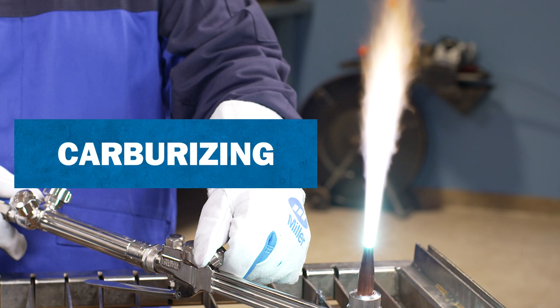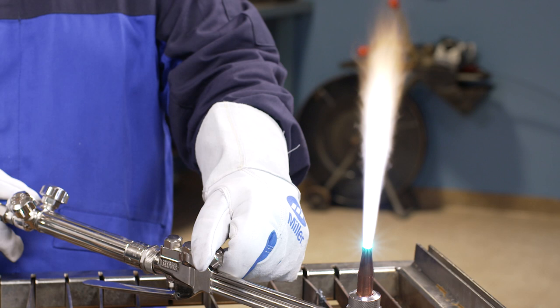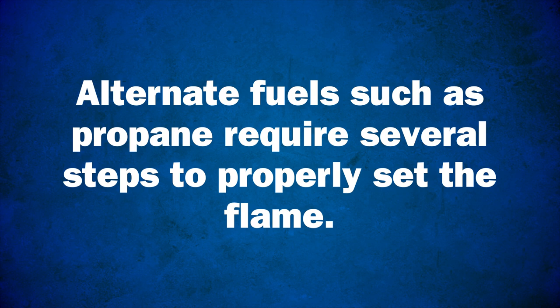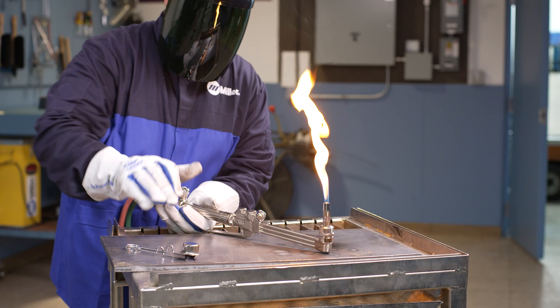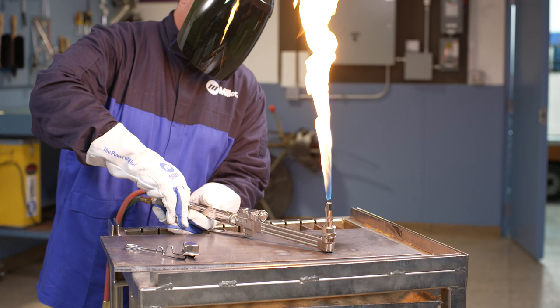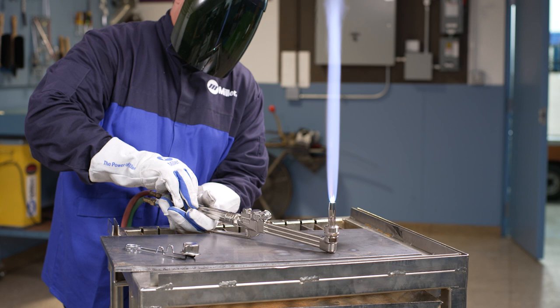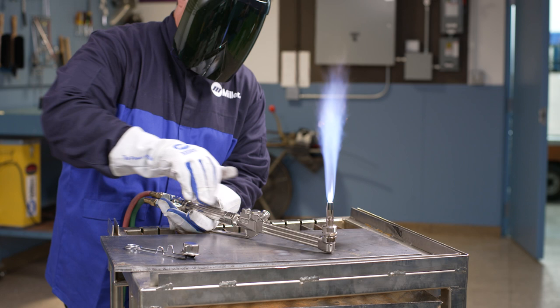Remember, we want a neutral flame, and when using acetylene fuel gas, that can be achieved quickly in a single step. Alternate fuels, however, such as propane, require several steps to properly set the flame. To set an oxy-propane flame, open the fuel valve about one-eighth to one-quarter turn and ignite the fuel. Now adjust the fuel flow until the flame just starts to separate from the tip, and add oxygen just as you would with acetylene. The difference is that with LP gas, we need to force the fuel through the tip for maximum efficiency and to prevent tip starvation, which can cause the tip to overheat. So with alternate fuels, we need to work the flame up by slowly adding more fuel and oxygen until we have a neutral flame with the fuel gas at or near full flow.